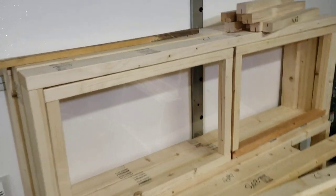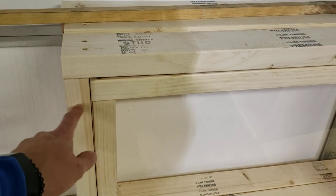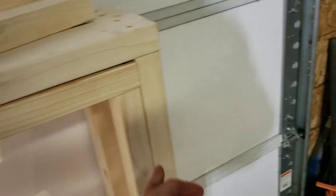What I'm doing is I took 2x4s. This was 62 and three-quarters, obviously minus the three inches for the inch-and-a-half on each side. I gave it a quarter-inch gap here, a quarter-inch gap in the middle, and a quarter-inch gap at the end, and I will center these windows. Nothing is done yet.